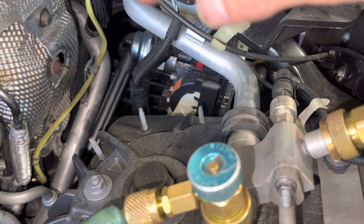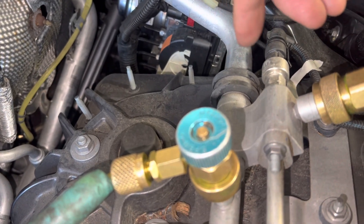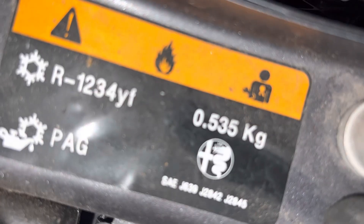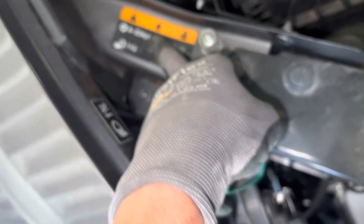This is especially important since they use YF refrigerant, which is even a little bit less efficient than R134a, and they're using smaller quantities. If you look at the charge quantity, we're just over a pound — 500 and some grams. Right here on the sticker: 535 grams is the charge capacity of YF refrigerant. That's roughly — I'm guesstimating — about $280 in refrigerant.